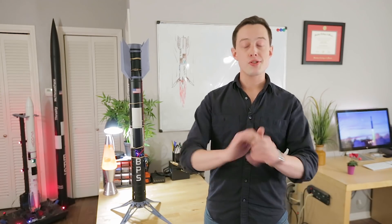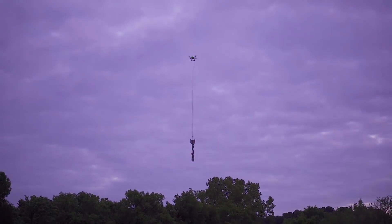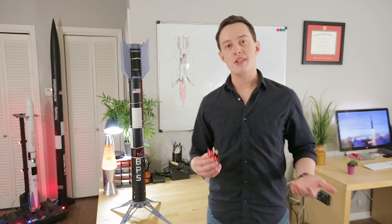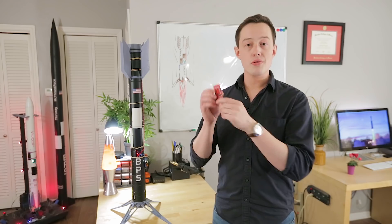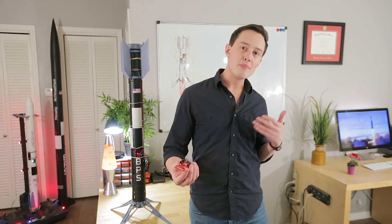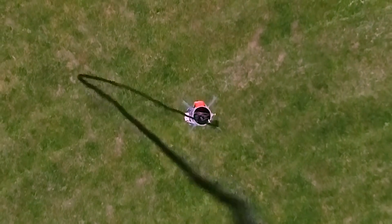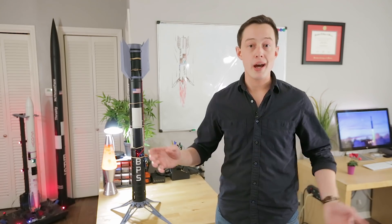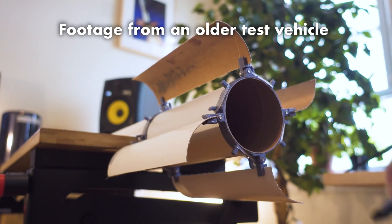Let's talk generally about how this stuff works. For these landing tests, I hook the rocket up to a UAV and lift it up to about 30 meters above ground level. As the rocket is going up, it's looking at all sorts of sensor readings — it has an inertial measurement unit with gyroscopes and accelerometers, a barometric pressure sensor for altitude, outputs for thrust vector control, and it's data logging. When it detects it's hit about 30 meters above ground level, it fires one of the pyrochannels, which heats up a nichrome wire at the top of the rocket, cutting the rubber band that connects the UAV and the rocket, separating the vehicles. As a side note, when we put the launching and landing programs together, these fins are going to fold into the vehicle to keep things more aerodynamic on the way up.